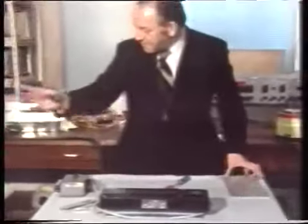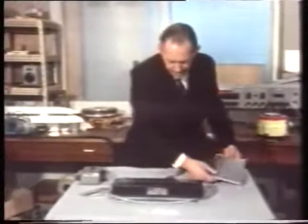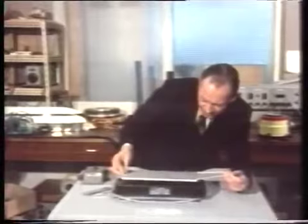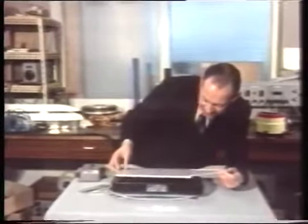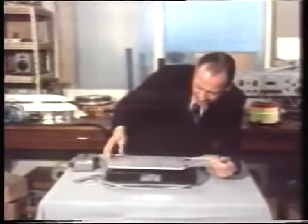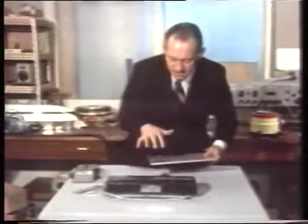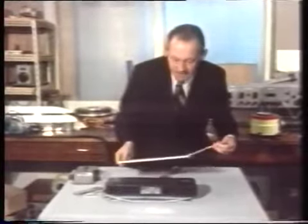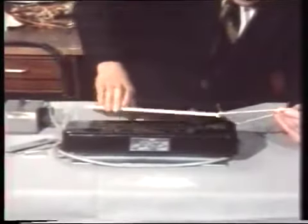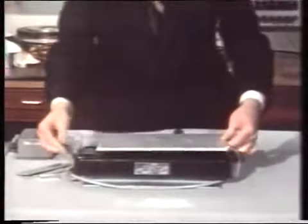Now suppose we increase the current. We can now hold a sheet of aluminium which is not only trying to be pushed along but is also lifting above the surface. It's much more like what you would expect if you threw a piece of wood into a flowing river — it would float and move along. So this then is the beginnings of a magnetic river. But it hasn't got any banks, because if I take my thumb away from here it'll fall off the side, and if I take it too far towards you it'll fall off the other side. If only we could stabilise it, then we should have something that looked exactly like a river.